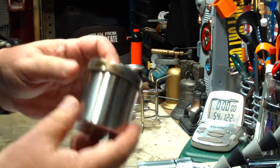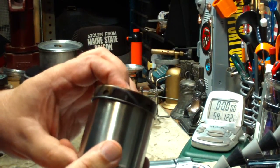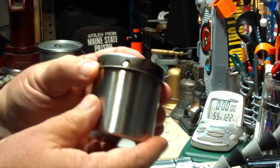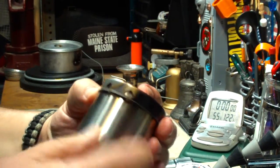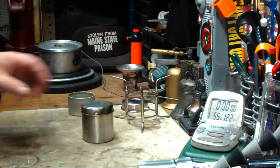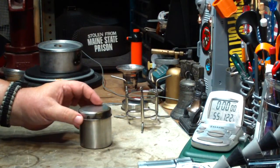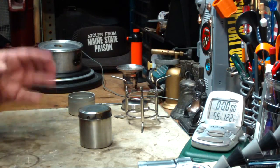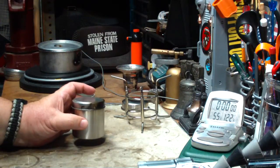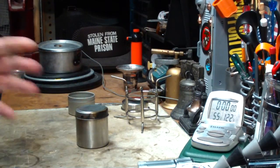So this will work with five holes exposed. When you put the lid on over the jets, five of the jets are uncovered. I just thought of something — I still have to punch a hole or two on the top here to relieve pressure, so it doesn't force everything out through the side holes. Where the big holes are, it lets the jets be exposed. So what I'll do now is get my water prepped, get one fluid ounce of methanol in this, and do a test bringing it to boil so I have something to compare with the last test. Then while it's burning I'll slip this on and see if the jets keep burning. The problem might be that with only five jets it doesn't stay hot enough to vaporize the methanol. I'll punch another hole or two on top and be right back.